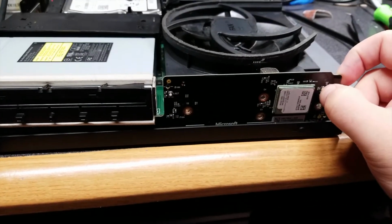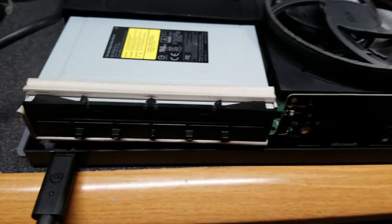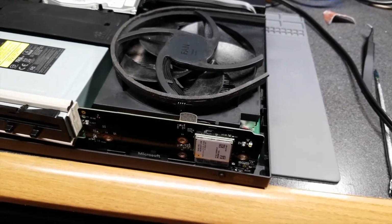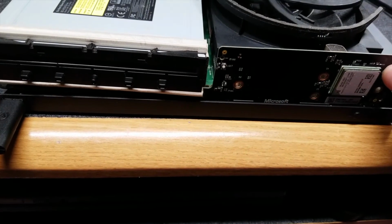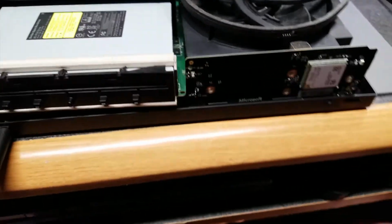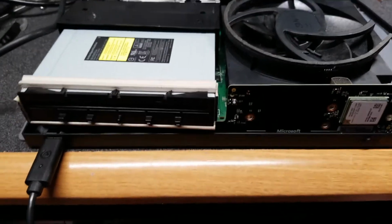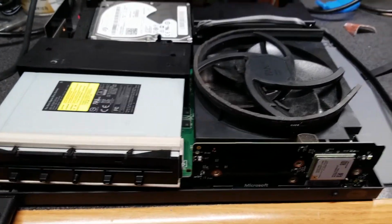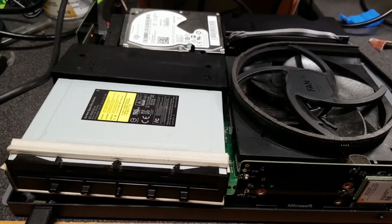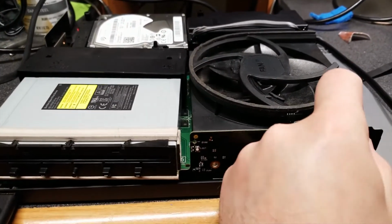Nothing still. So that's interesting. Make sure that the surge protector is on. All right, let me try making sure that this is actually secured. So yeah, no luck. I'm not even getting any voltage readings out of the power supply itself. We know we tested it earlier and it was providing 12 volts, well, 11.95 I believe, so close enough. But I cannot get this to turn on at all.